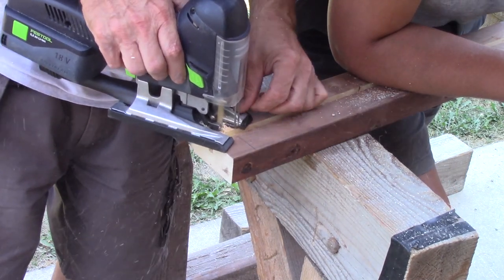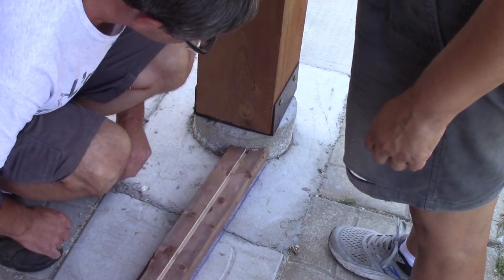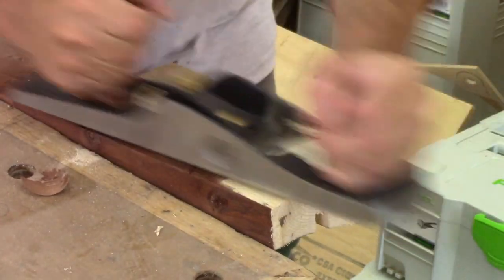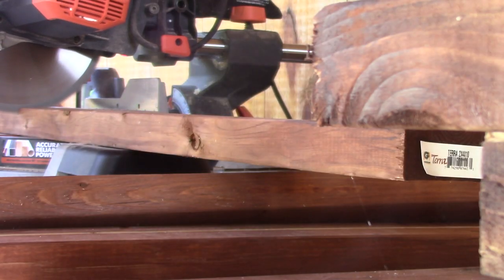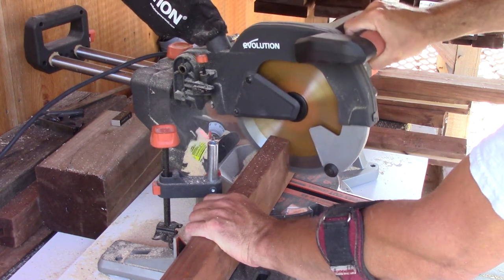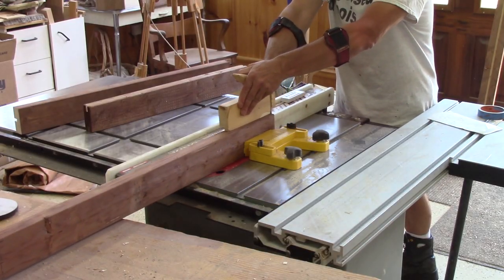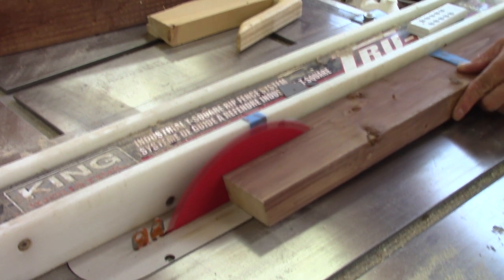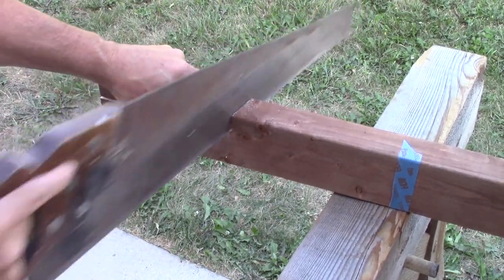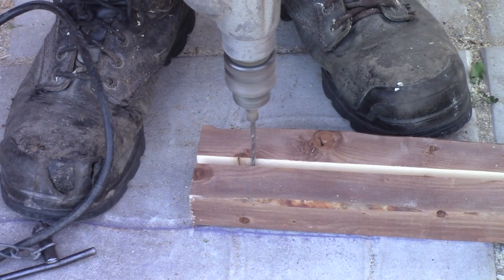Doing this side is fairly similar to the other side, but it doesn't start well. The concrete goes up near the post — this needs to be fixed. And after planing it, the rest goes like a charm. One thing is a bit different: I need to cut one two-by-four at the same angle as the roof. On this side, the base plate will be screwed to the concrete.